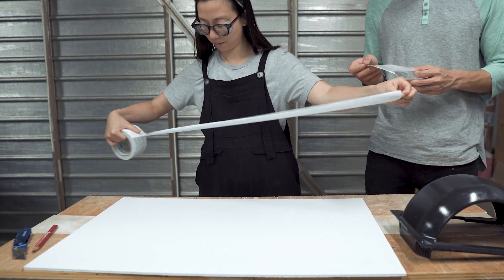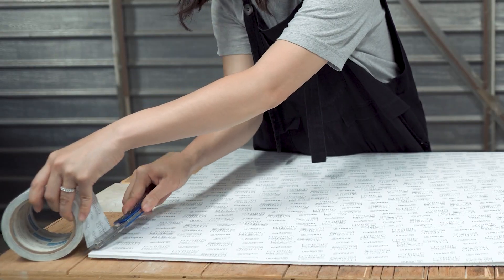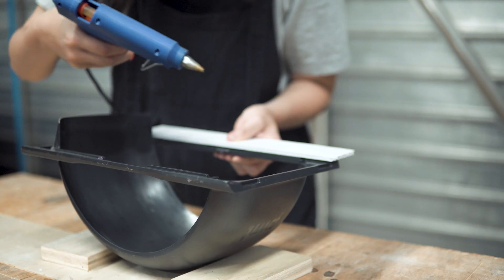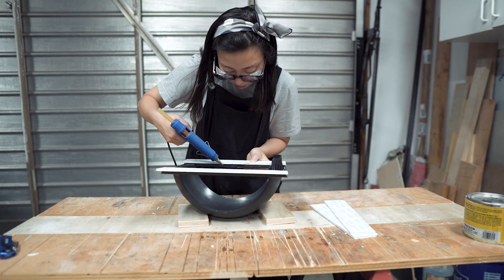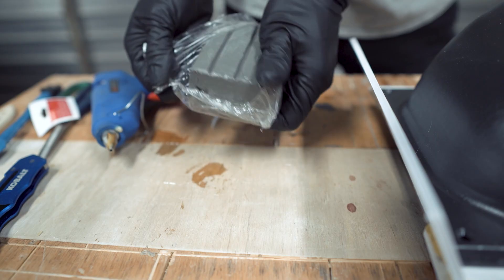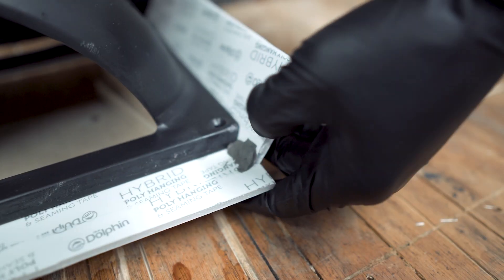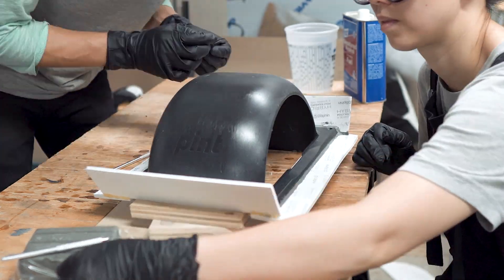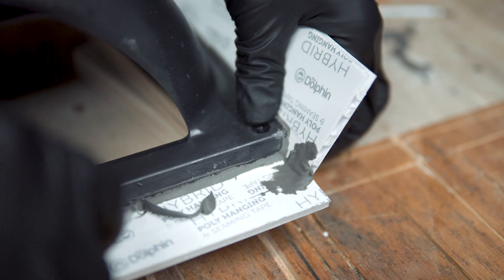Setting the fender aside to dry, we covered one side of some foam core with seaming tape, then cut and hot glued the foam core around the edges of the fender to create a lip for the mold. We chose to make a single piece mold mainly due to lack of experience — it would have been much better to make a two-part mold split along the length of the fender for easier demolding. We used modeling clay and scraper tools to maneuver clay into the crevices and smooth out the transitions.